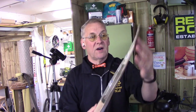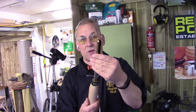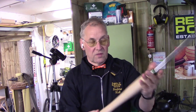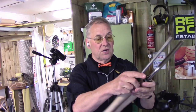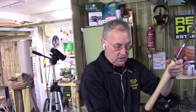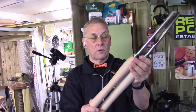I'm going to take a new half-inch ball gouge and put the swept-back grind on it. It's covered in wax — take that off carefully and there we have the traditional grind on there. This has the larger handle; I prefer the larger handles. The one in the kit has a smaller handle, but that's a nice size for your starter bowl turning kit.